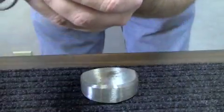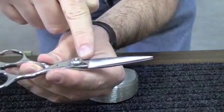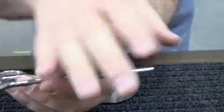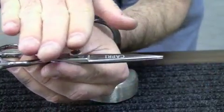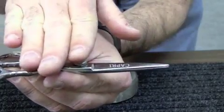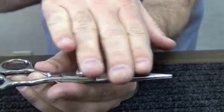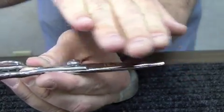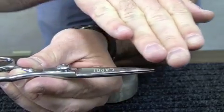What's happening with this shear is it was caught in a wheel, and on the top part of the shear, right here on this particular blade, it was actually bent. It was hit by the wheel and twisted up this way. So the blade, instead of having a gentle curve of set from the back of the ride area, back around over the top of the screw and then back down towards the tip like it should — it's actually bent from about this point upward.